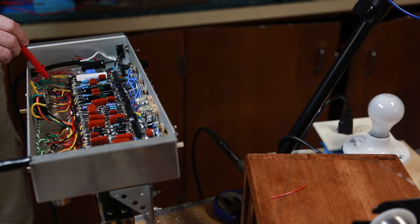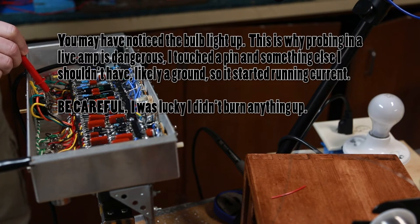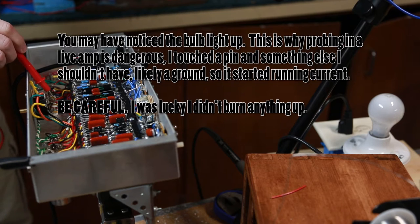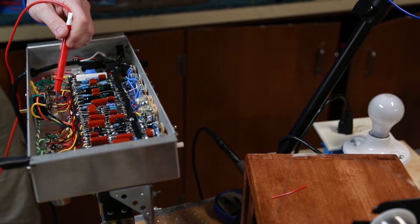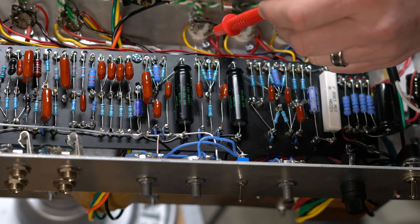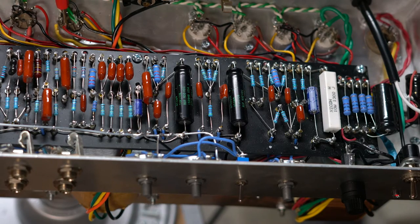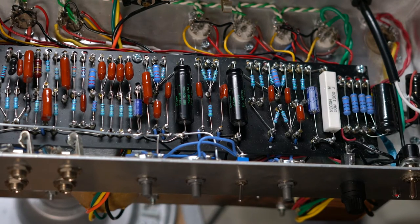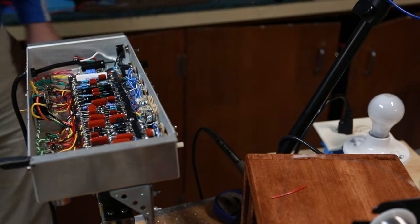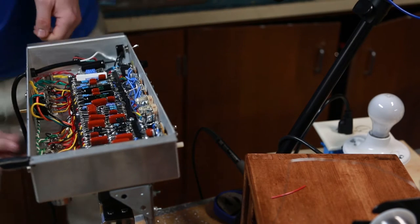What I also like to do quickly is check voltages in a couple of places — 389... 390... 390. Okay, so that's looking good. 389. Okay, so we're getting voltages all the way down and my rectifier is glowing. We're gonna turn it off and I'm gonna put in all the tubes and then we'll see you around with things.